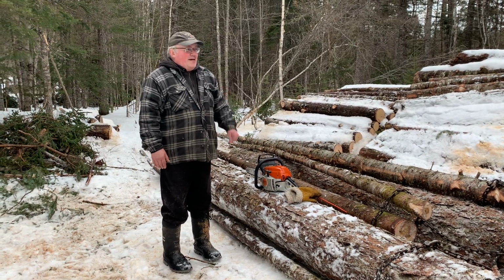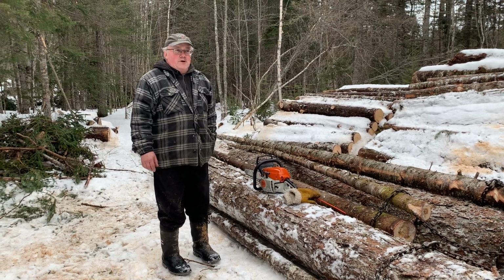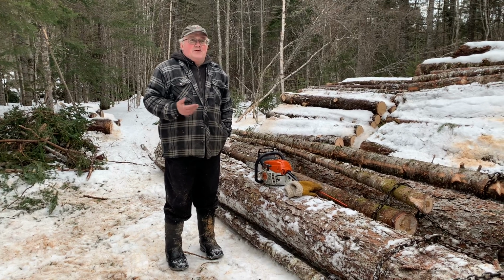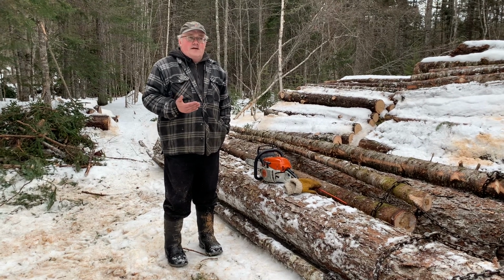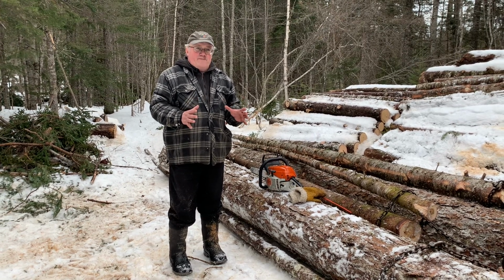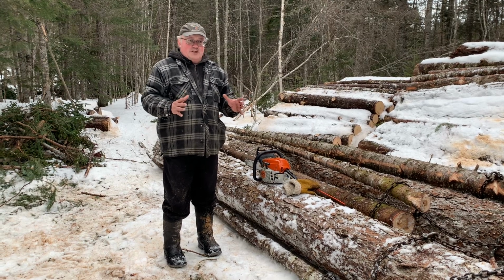It's very rare today. In this province, I don't think there's any more sawmills that buy by the cord. Now they buy by weight. And so if you went online and looked up a table of the different specs and what different sawmills are paying, you look at the Woodlot Association Marketing Board pages, you'll find all the prices given in tons of wood, and it's measured by the metric ton. Now that's calculated on X amount of wood weighing a specific weight, and they average the weight of that wood over the course of the year, spring, summer, fall, winter, and they balance it out.